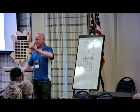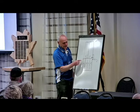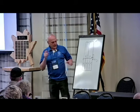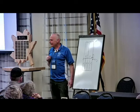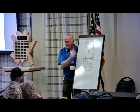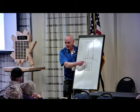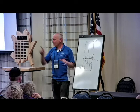And then tomorrow when we fire up, we're probably going to switch sides, aren't we? We're going to feed this side and draw from this side. So we reverse the rotation of all the feeds. And we're going to dump that pail A where? Now we're going to dump it in right here, and it's going to push this stuff right back. But you know what? We better dump pail B in first, because that's the 40. I'm sorry. So we dump pail B in, it pushes back, then the pail A pushes the B around. That sort of makes sense. We've now set the gradient on this machine, so it won't do that trick to us today.